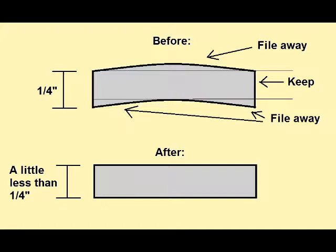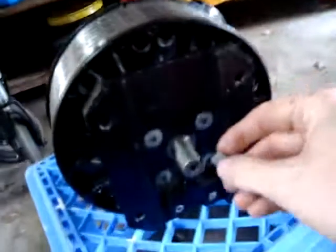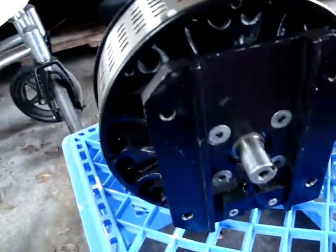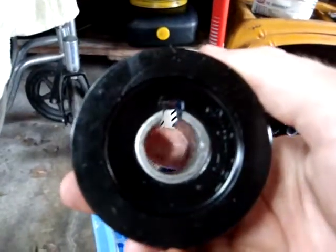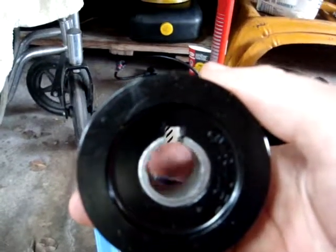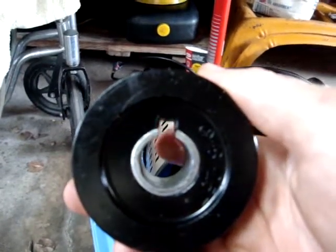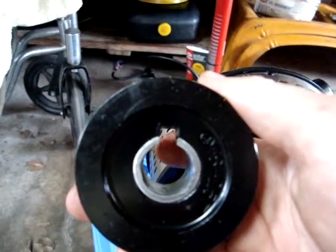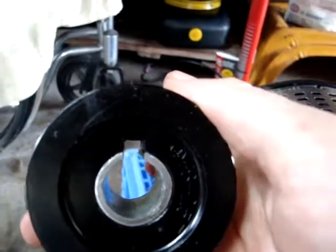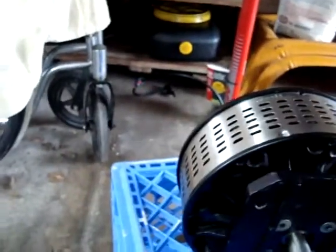Once that's cut off, the next step is making it fit in the slot. If you look at a cross section of this piece of metal, it's not exactly parallel — the top side and the bottom side bow upwards a little bit. Here's an exaggerated view of it on the computer. With that bow, the entire piece is more than a quarter of an inch thick, so I had to do a lot of filing to get the two sides down smooth and parallel. Once that's done, the final thickness is a little bit less than a quarter of an inch, but it slides into the slot on the shaft and also into the slots on the pulley. The sleeve has to be pounded in with a hammer and wood — it's a tight fit. The key is to put in the keyway first, then tap the sleeve into the pulley, then you can take the keyway back out and the sleeve stays lined up like it should be.